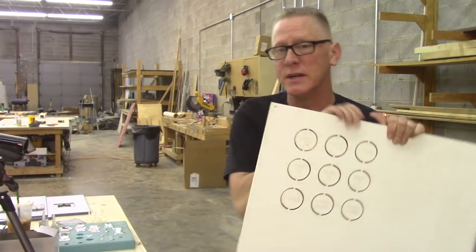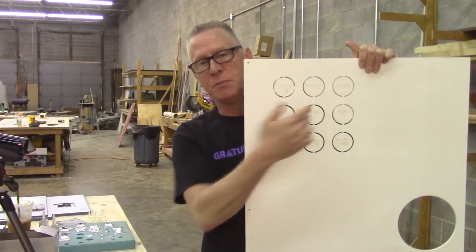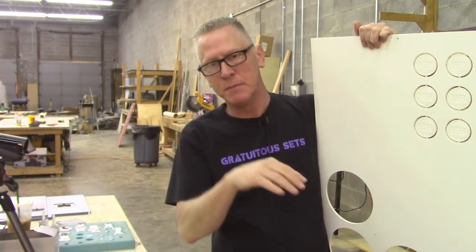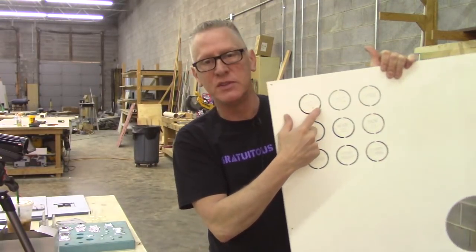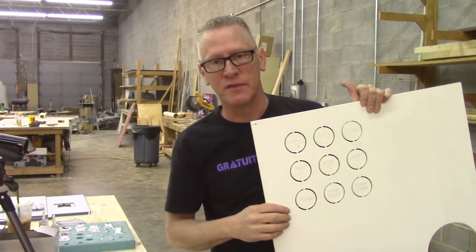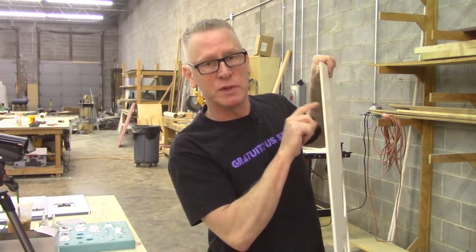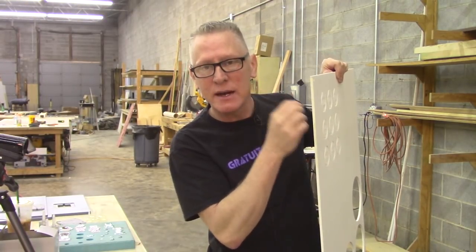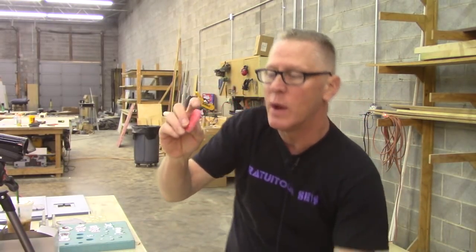Now the reason that I'm showing you this one is because, of course, this one screwed up. Trying to measure from one side, hit a point, and then go from the opposite side with the CNC machine is not the easiest thing in the world. So, you know, doing a flip mill is not the easiest thing in the world. So this side is about a 32nd inch off registration. It might even be visible to camera. But so that's not good enough. And we did it again. But that means I have this thing to show you. Sintra, by the way, which is what this is, is PVC, and it's slightly aerated. So the edge has air bubbles or tiny little air holes in it that have been dressed out with sanding and this dissolved wax, so I do have a smooth edge.